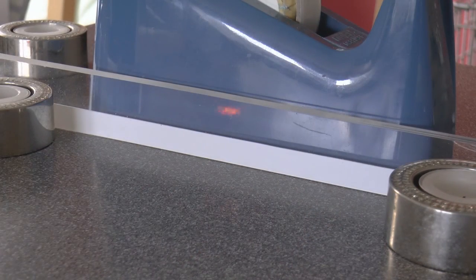I'll turn the beam on, have a look at where it is, then rotate it 180 degrees and check where it is — and it is low. That means I can raise this up by screwing down on the screw that is at the top. If I wind this screw down, when it touches the body — there we go, it's starting to come up now. Now I've got to find a central position. If this worktop is flat, then when I turn it over my beam will be in approximately the same position.